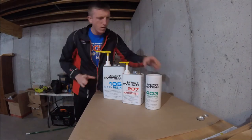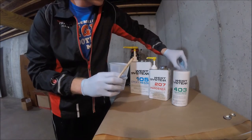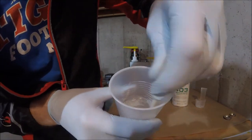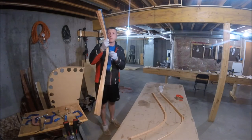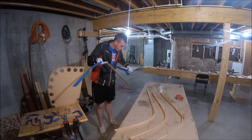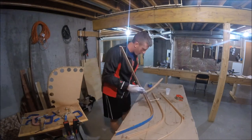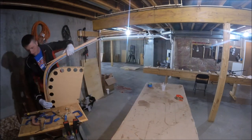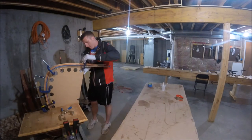After 48 hours, it was time to glue up my stems with the epoxy. I'm using West Systems — they have these little screw-on pumps and it's literally pre-measured: one pump of the epoxy, one pump of the hardener and you're set. For applying my epoxy, I put a piece of blue painter's tape between my inside and outside stem just to ensure that I didn't glue them together. I used a little bit of the West Systems filler to thicken my epoxy and make it more of a glue texture. I simply brush this on to both mating surfaces and then clamp it back onto the stem mold station for another 24 hours.